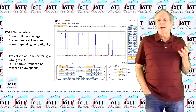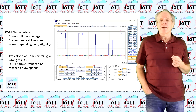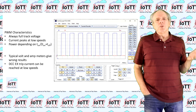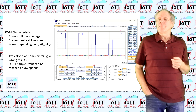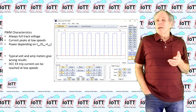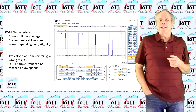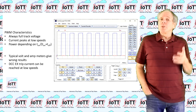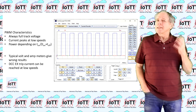This signal form also explains why current measurement is not that easy. I set the DCCX trip current to 3A as you have seen in the motor driver configuration. DCCX measures the momentary current to determine a short circuit situation. If you use a multimeter on the other hand, it gives you something related to the average current over the entire PWM period. So if the speed setting is very low, the trip current may be achieved and the short circuit detection triggers, but on the multimeter display you only see like one tenth of the defined trip current. Just don't be surprised if the command station sees a short circuit at very low speeds, while at the same time you get a low current reading on a multimeter — it is because DCCX saw one short current spike higher than the trip current.